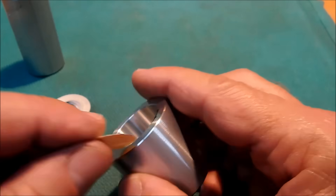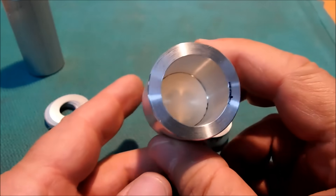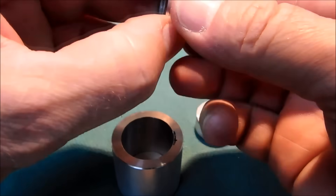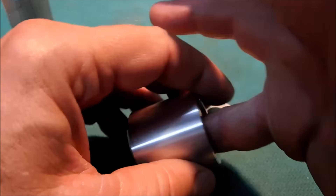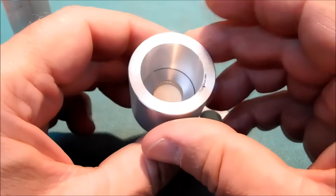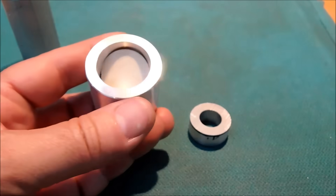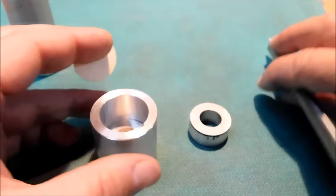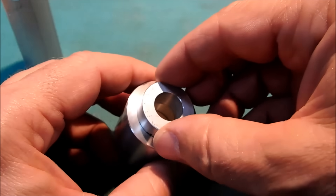What we're going to do is put a piece of clutching material in this cap. Clutching material is the same used for the pressure turning operation - you want something that's going to apply a little bit of friction between all the parts. Now let's put the parts in. Clutching material in the front, about 300 thou worth of parts, more clutching material in the back. I'm going to put a slug in there just to back it up.